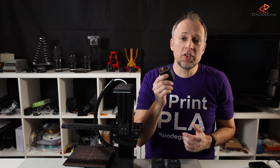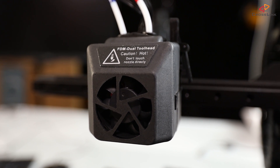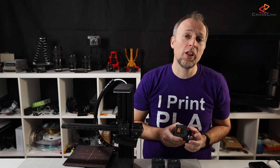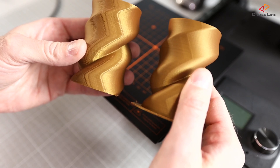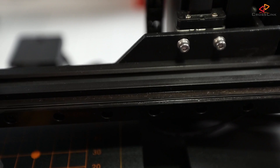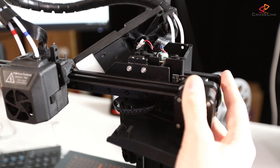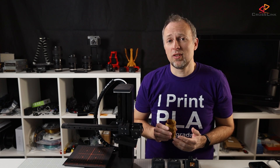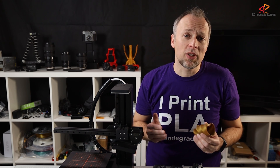The 3D printing module covers two of the four functions — single color 3D printing and dual color 3D printing. If we look at the results from my first print, that wasn't going that well. I had to tackle some issues with belt tensioning, friction on the z-axis, and the x-axis horizontal alignment with the print bed before I could get out a decent result. I figured them out, but it wasn't part of the setup instructions.